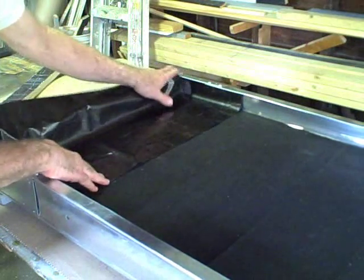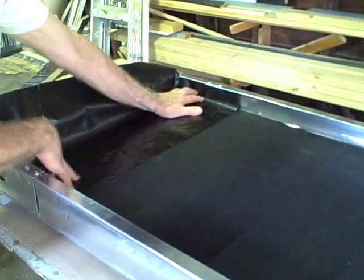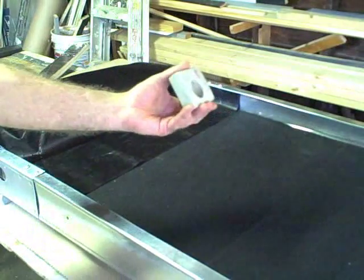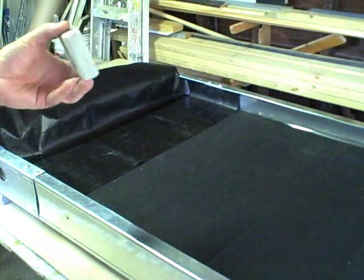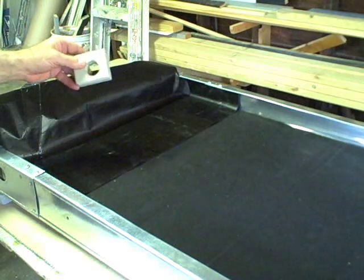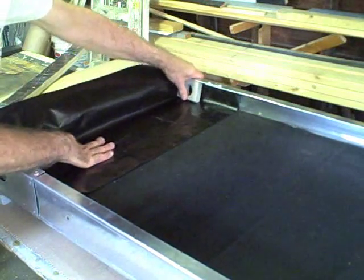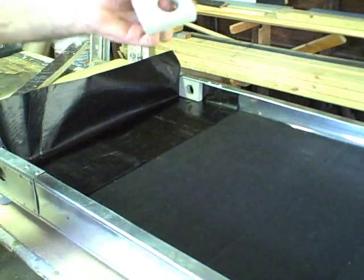The other end will be free to fit between the edges of the steel stud slot frame. The distance is just about right — it will be about an inch and a half from the very edge of the collector. We're going to hold that in place with these trickle down tube supports. This holds the bib in place and also prevents the trickle down tube from being cut by the rough edges of the steel stud slot. It's going to go in a position like this — just press that in place. We have two of them: the right one and the left one.